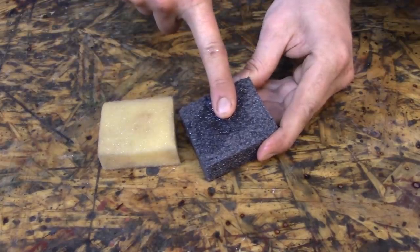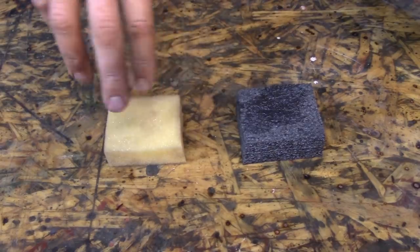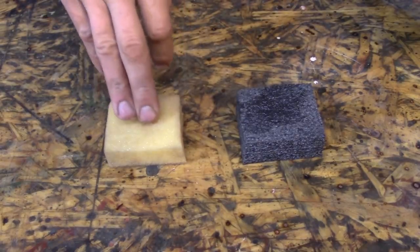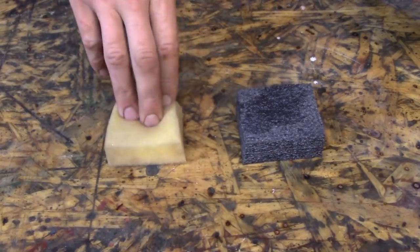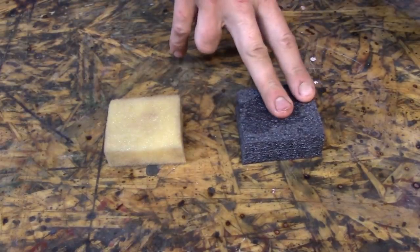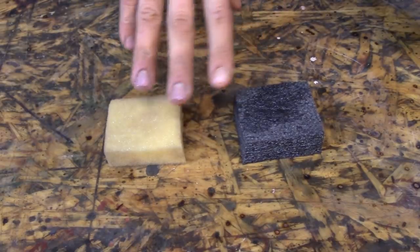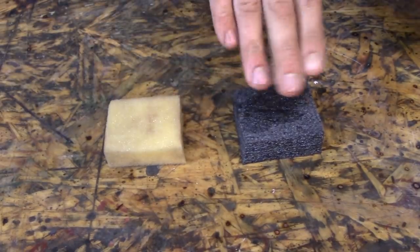This is similar to granite. This is similar to sandstone. Sandstone readily absorbs water. It has enough closed cells in it that if you heat it up and it is saturated, it will explode. Granite cannot absorb very much moisture, and if you get it warm, it won't. And there's lists on the internet that tell you which types of rocks will pop when you heat them up with water in them and which ones won't.